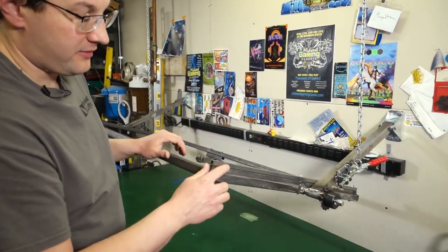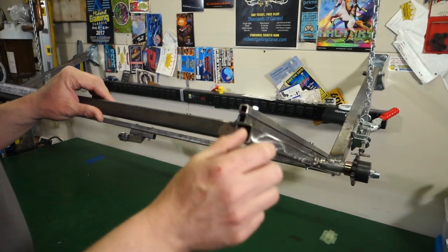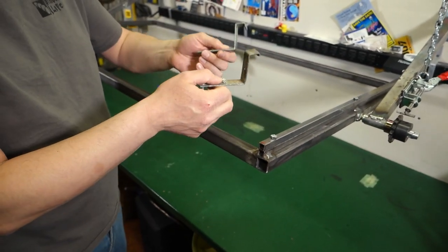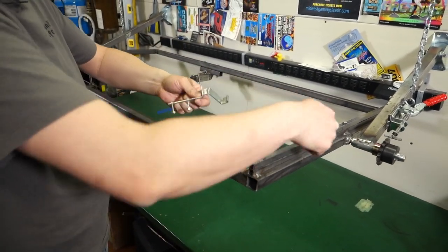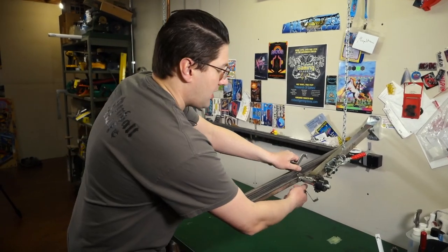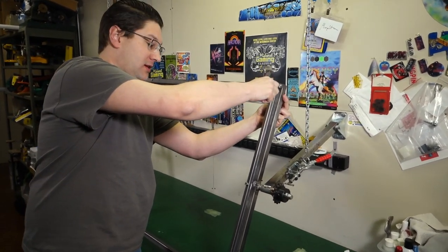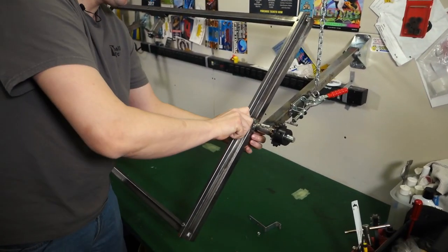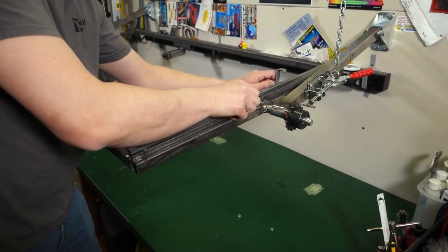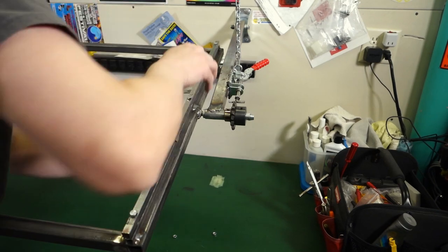On this side we have two half-inch square tubes. The bottom one is welded in line with the inside of the one-inch tube and the top one has three holes drilled through it and is bolted. This is to clamp the playfield — you have the hooks. I looked at how Stern rotisseries bring playfields in and out quickly with little clamps that pop on. I wanted to make it more universal. This bar lets me take these bolts out — not quite as fast as Stern, but for a home rotisserie pretty quickly. You tighten the three bolts down and it gives a lot of flexibility.